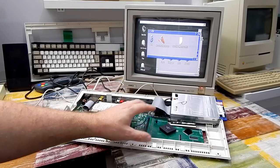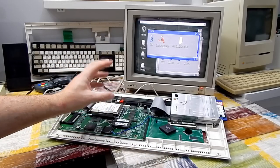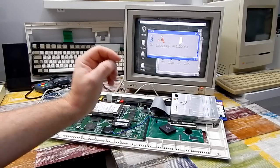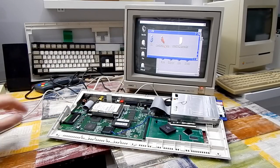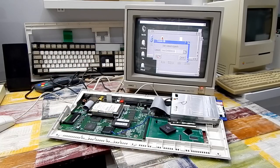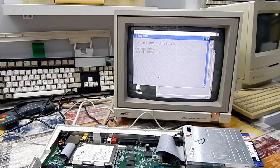Yes, we do have a nice fast 030 processor here on the accelerator, but the majority of software that I would want to run that needs the floating point unit is also looking for a considerably faster processor, something like an 060. This demo though, Jesus Christ Motocross, needs an FPU and it runs really well on the 030, although all its FPU stuff, it pre-calculates.